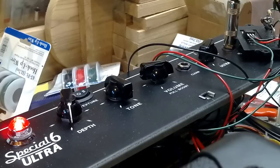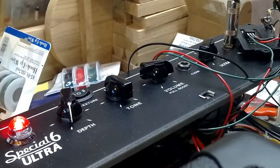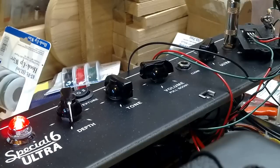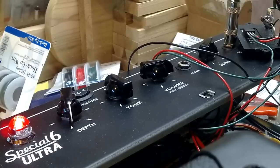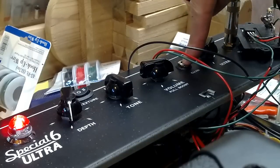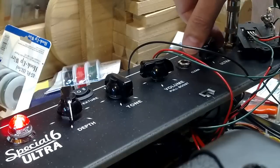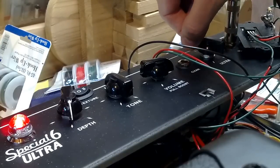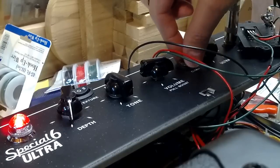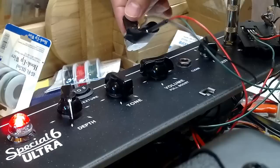The nice thing is no noise — dead quiet. I've got this mess just sitting out here already, but it works pretty well. The idea is to try and put it somewhere inside the amp. I want to install this brick down below in the chassis. I'm going to take out the clean input because it's really not necessary — you've got adjustability for very clean or very distorted signal at the very end. So I'll use that location for the reverb pot.